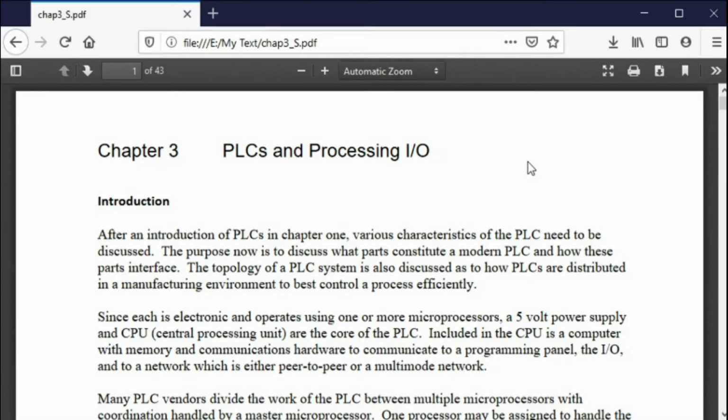Okay. So what is this PLC idea? Well, it's the same thing as what we talked about in chapters 1 and 2, except for the fact that now you're simulating on a computer the actual relay logic that you saw developed in chapter 2 with relays. So the whole idea, as it started out, was a replacement for relays, timers, and counters. That said, it's a computer. It can do anything that you can program, and it's sequential in nature, and with that you can do a lot more than you could with just straight old relays.